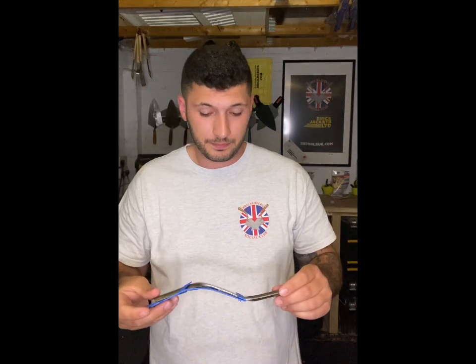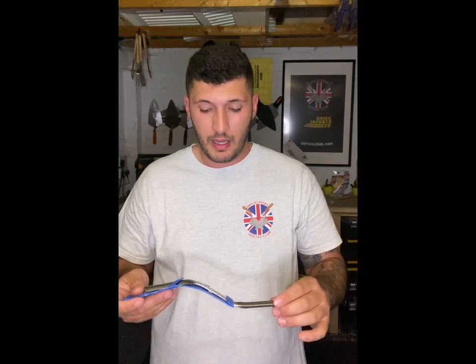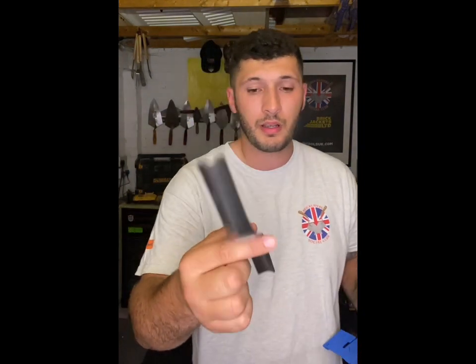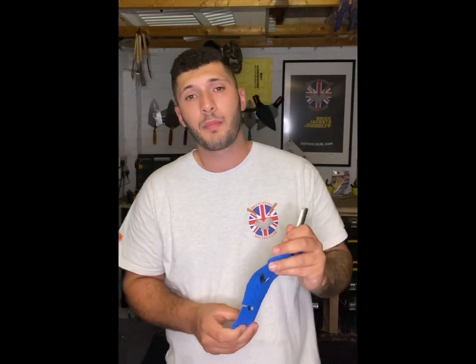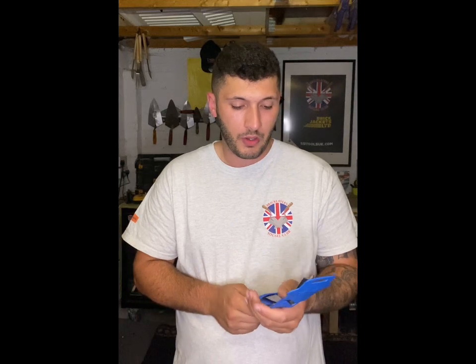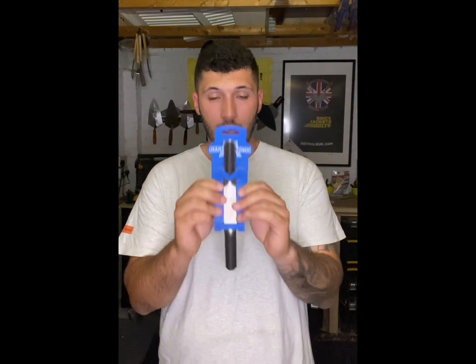We spoke about dingers just the other day — they're really good but they're for later down the line. We've gone with the Marshalltown Number 82 brick jointer, which is good enough for brickwork and blockwork. When you've got a bit of time under your belt, go buy yourself some dingers — they do a wicked finish. But for the time being, don't get ahead of yourself. Use the basics first; they are great tools and have been used for donkeys' years.